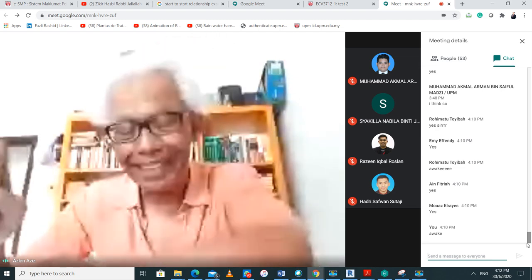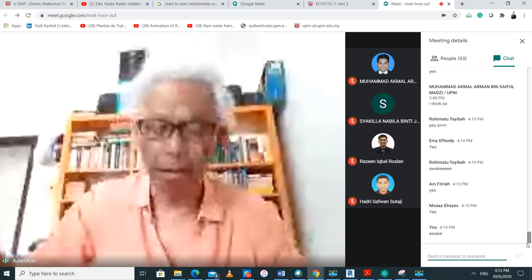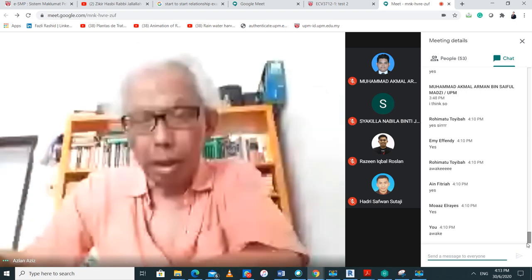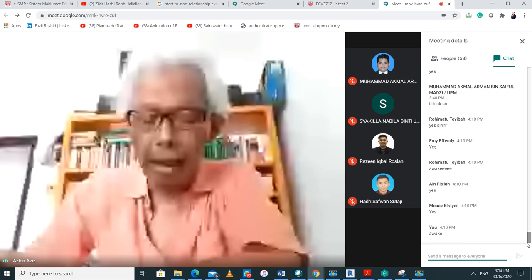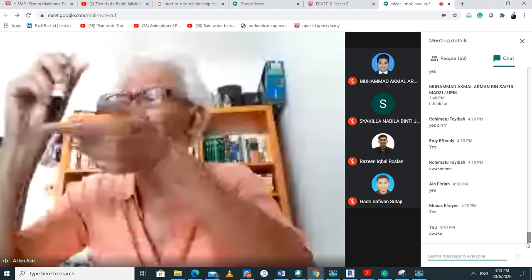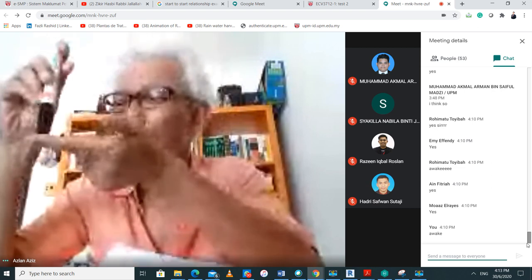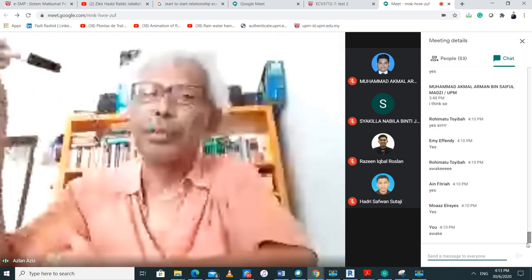Now, in the second one, the diagram in the middle is the variation of the end bearing capacity, right, and also the skin friction along the shaft of the pile. So the end bearing capacity at the tip is going to be a constant value because it's at some depth there, which is a function of the shear strength of the soil, okay. And then it is only at that depth and you just multiply by the area, which is constant. So Q sub U is always constant there.